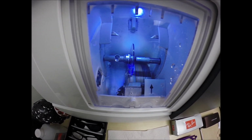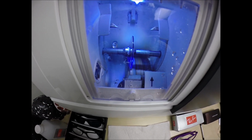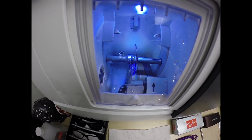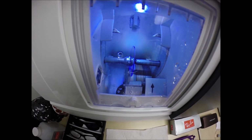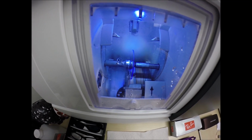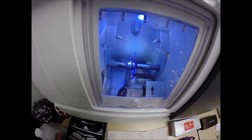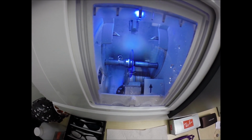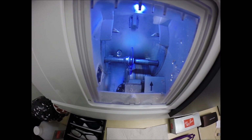Your material, the polycarbonate, cuts dry, meaning that no water sprays onto the lens while it is cutting, unlike plastic, high-index plastic, and Trivex, which are different lens materials that cut wet, meaning that water sprays onto the lenses for the duration of the cutting cycle. Now, water will spray onto these lenses, but only for the last 20 seconds, to wash away any optical debris that you may see beginning to form on the edge of the lenses.